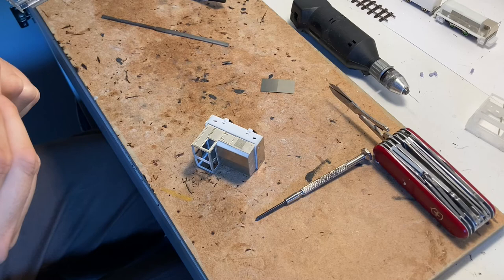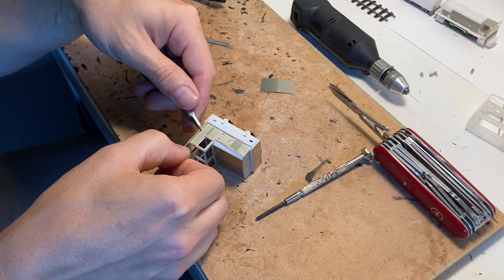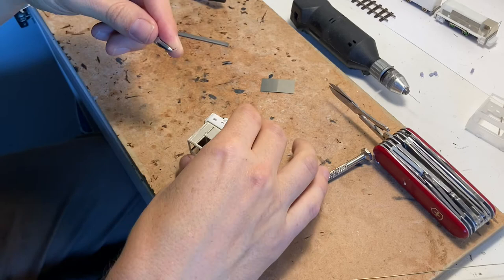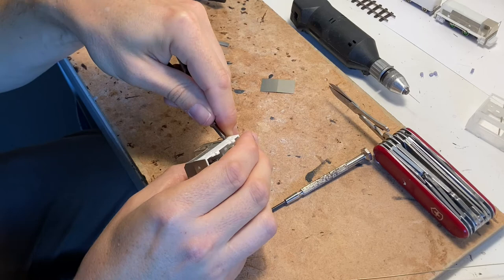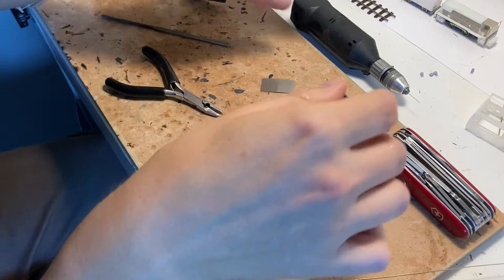Of course, in this case, actually, there's only 4 handrails to form, which is quite nice. So again, into the hole, because these have got the plastic framing behind, they're a little bit more resistant to pushing in, but they'll be okay once they're formed. I don't want to force it yet. That's a good match. I say, because I've drilled the holes behind these at 0.4, these should be a tight fit. Actually, I might need to spin these holes out to 0.5. Let's have a look. Because the holes are already formed, it's quite straightforward.